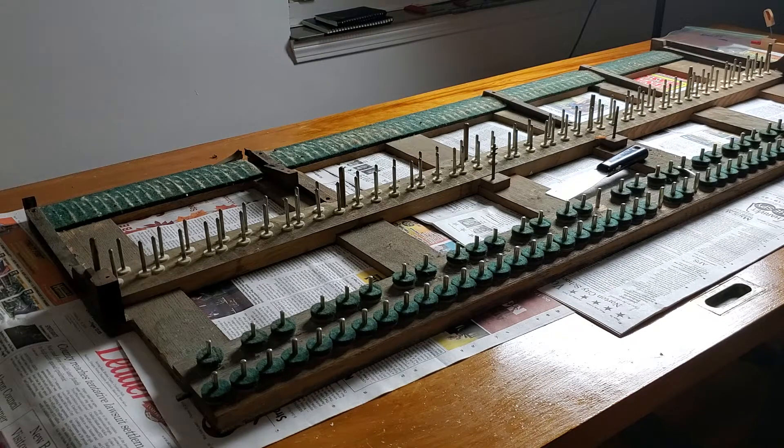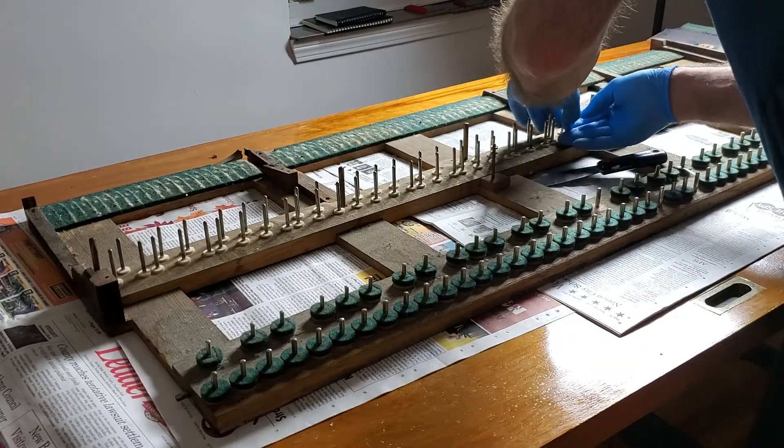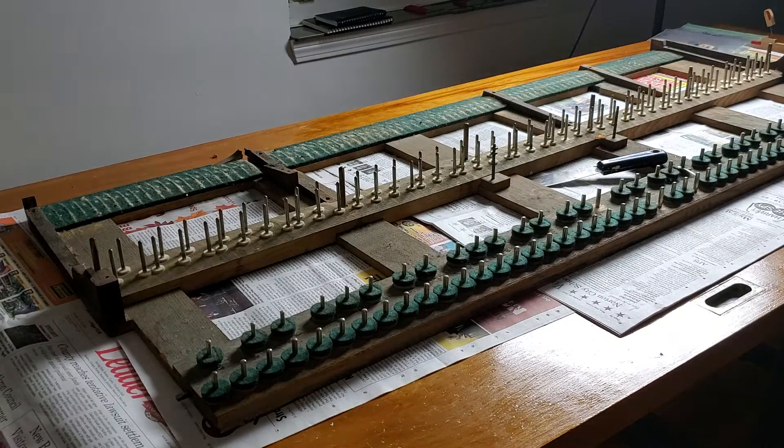Now we've set that side — rear sample. We're going to do the same thing for the center pin. It doesn't really matter which one — center pin sample. All I have to do is match that specification and that mix when I rebuild. In other words, if my mix of spacers and felt comes to this combined thickness and I'm setting it up the way it was, it's a good starting place when you refelt. So I now have three samples: the center pin, and these two.